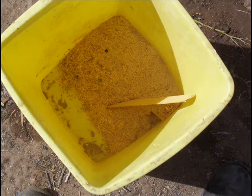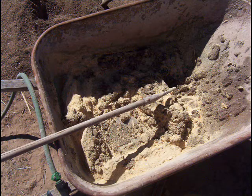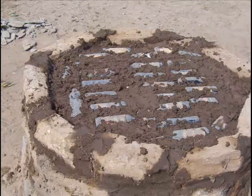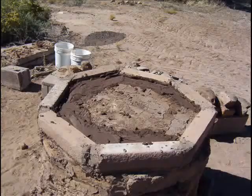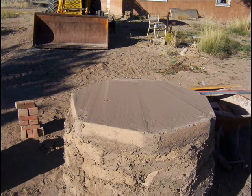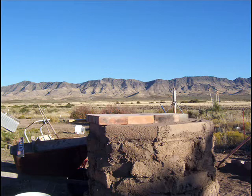After that, there's an insulative layer — a mixture of sawdust and adobe mud. The insulation prevents heat from going down or out of the oven. You mix the adobe clay and sawdust and place it around beer bottles, which help provide insulation. In the center there is a thermal pad on top of the beer bottles, then fill in around it, and on top of that there is a sand layer that the bricks sit on. You want to make sure those bricks get laid very level, flat, and smooth.